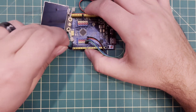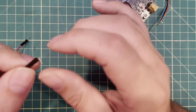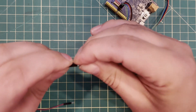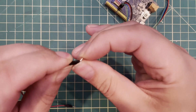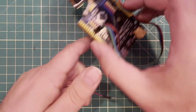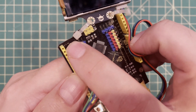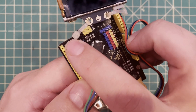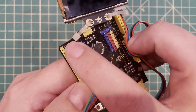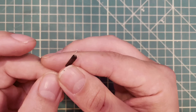Tip number three: if you do happen to bend these pins, I highly recommend you just go ahead and get rid of the cable. These are just not made to bend very many times. You might get one or two bends out of them, and then the end can snap off really easily — and it's not uncommon for that end to snap off right inside one of these connectors. I've found it to be nearly impossible to get that pin out if you break it off inside something. So if they bend, get rid of them.